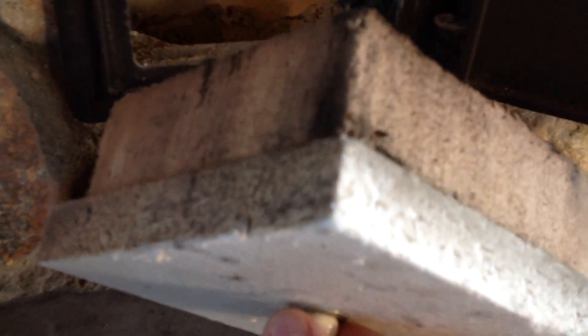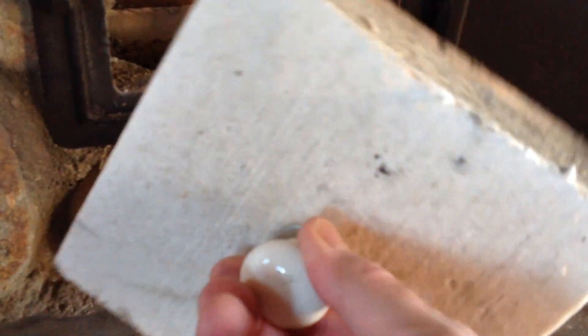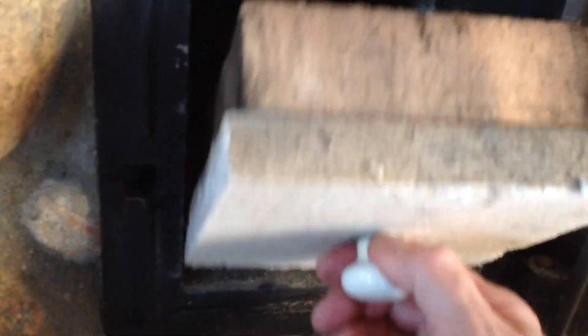The clean-outs were all built kind of similar. What I did is I made a plug of that ceramic fiber board and put a little cabinet handle on there to be able to pull them out. It's the two inch ceramic fiber board with a one inch ceramic fiber board over the top of it, and that's just a glass handle for a cabinet. The washer and the screw just tighten them all together. They just fit right in there snug.